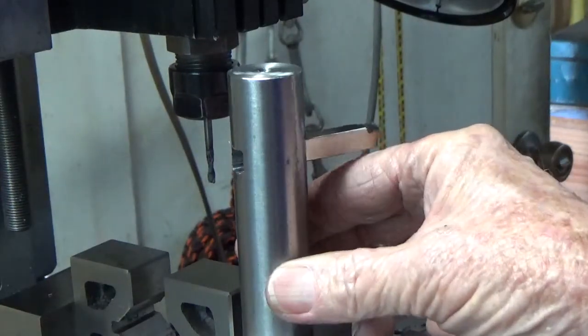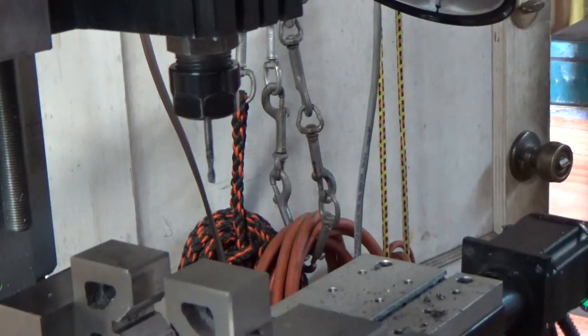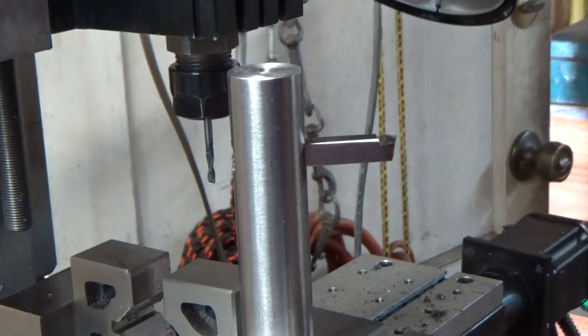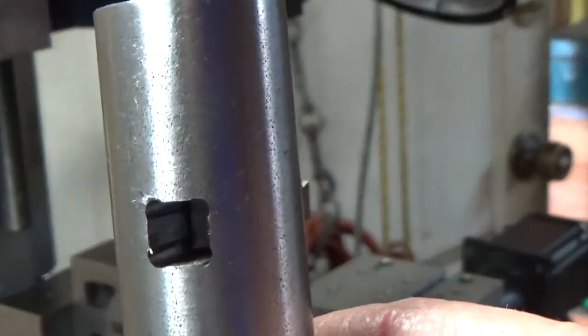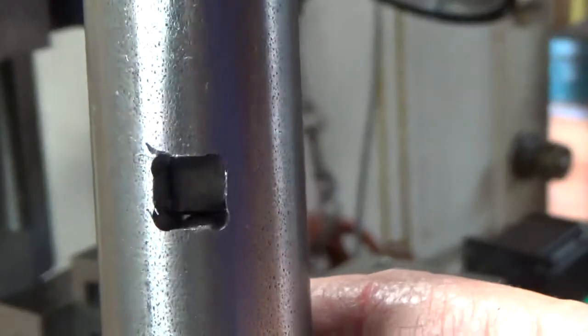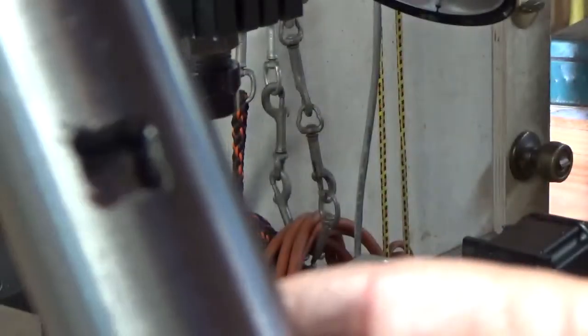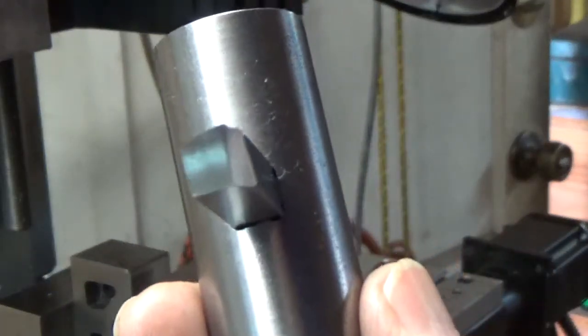It's within a thousandth of an inch going in the other side. I didn't leave any play, so it just depends on how much slop is in the mill and how much spring is in the end mill. It goes right in halfway, no problem. It's going to work — fits just like a glove. I'll hit it with a needle file and clean up the couple of burrs in there. The corners are all cut out. There's the back side — you can see the burrs where it came through; some deburring to do there. I could have brought it through further but I was getting awful close — that was really pushing it. It did work. We got a nice hole through there — this is going to make an ideal holder.